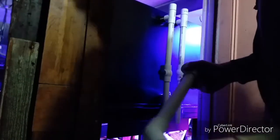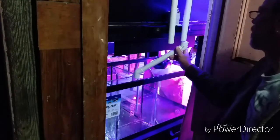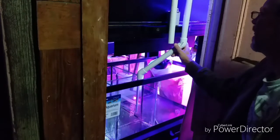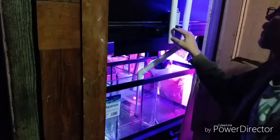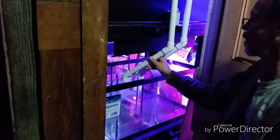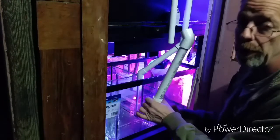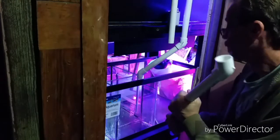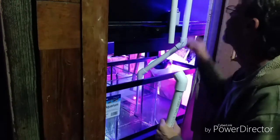I also pre-glued two 45s — I kind of pre-measured without you guys, I hope that's right. These are going to sit like this. I built out a piece of 2x4, trimmed it down to about two and a half inches, so I can clamp the pipes to it. I'll also have pieces that extend down into the sump but those I won't even glue — they're just press-fit so you can remove them if you want to put filter socks in. I've noticed on the other tank they don't fall in, so we should be fine.